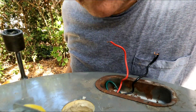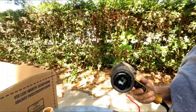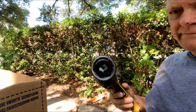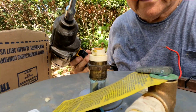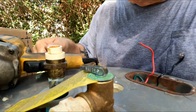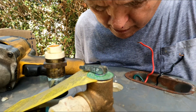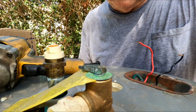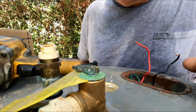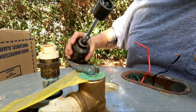Damn. So that's what was left of the anode rod. Nothing. Totally eaten up. I'm going to try to take a look down there and see if I can even see the rod that the zinc was on. But that's why this failed — because there was no anode, there was no sacrificial anode.